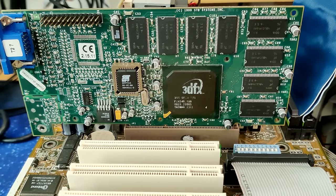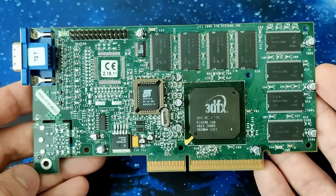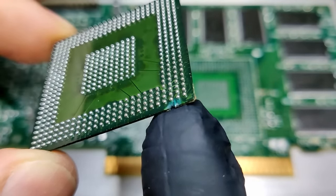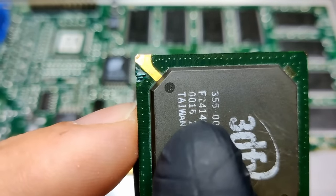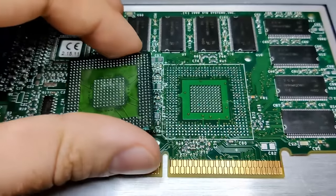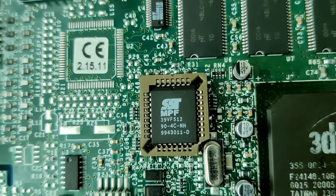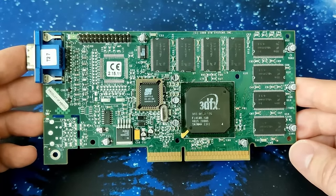It was a long shot anyway. The card doesn't work. So what could be the possible cause for the card not to work? Well, there are plenty, and some may have been caused by myself. First, I could have killed the chip with excessive heat — and although I don't want this to be true, the possibility is high. Did you see the discoloration on the underside of the chip? Maybe I just had too much heat going too fast on the chip when I tried to remove it. Other possibilities include that some solder balls did not make a proper connection to the board, or there are still some traces that are broken which I haven't noticed. It could also be that part of my repair was undone while reattaching the chip to the board. Of course, there could also be other issues on this board because I suspect someone else has been working on it before. And finally, the BIOS could be faulty — but I did address this and reflashed the chip and even soldered a socket to the board. The card still did not work after that, even though the BIOS on this card had a few bits different compared to the BIOS I downloaded from the web.